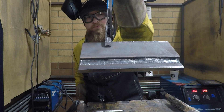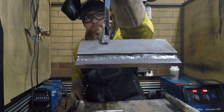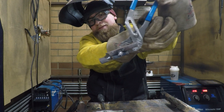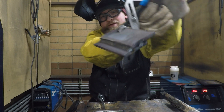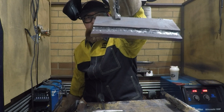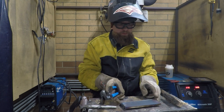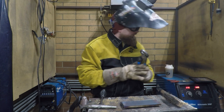You can see that lap joint is nice and even in there, maybe wandering slightly, but that would be leaving the edge exposed. Let's go ahead and do another one where I throw a multi-pass down in there.